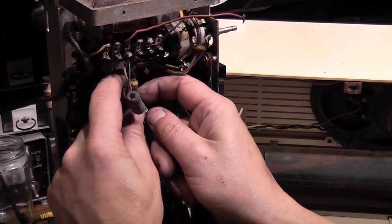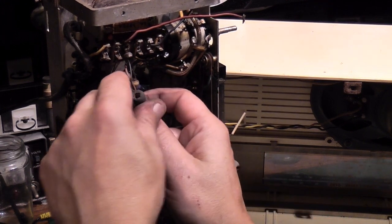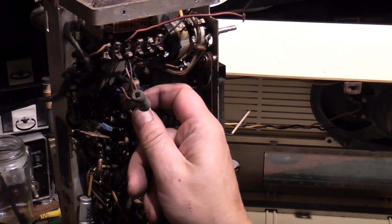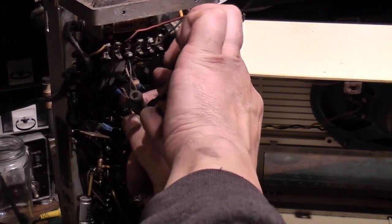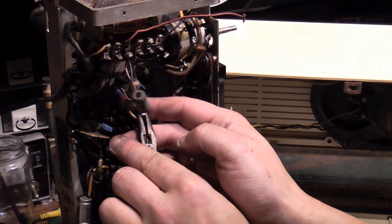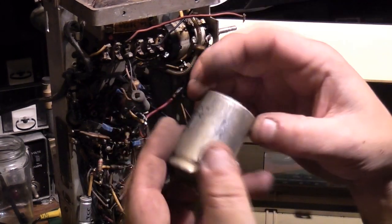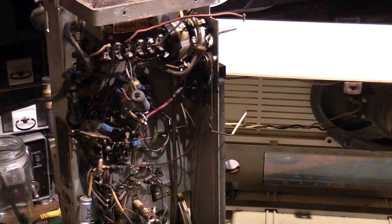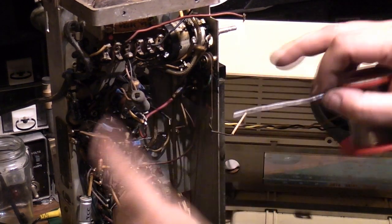And again, we'll just bend the new wire and basically solder it to the old lug that we took off. If you were properly restoring this radio, and you were using separate capacitors, rather than either remanufacturing yourself, gutting the can and doing it like I've just described, or buying a new capacitor in this form factor, which you can still get, although they're incredibly expensive, what you'd do is similar to me: use 3 separate capacitors, but you'd connect them to some tag strip and mount them on the top, and then redo all this wiring.